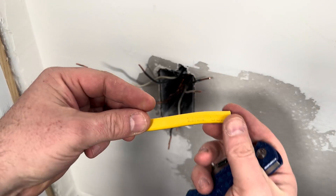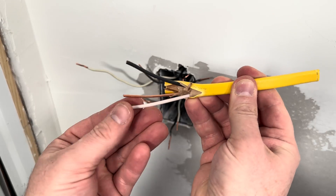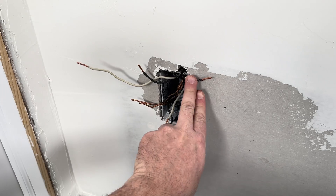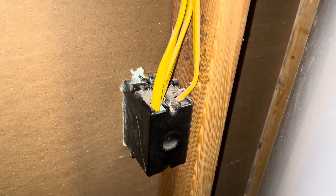To show a better view, if I were to cut open one of these yellow cables, inside you would find a black, white, and copper wire. To find out which ones are bringing in power, I need to separate the wires by cable. There's going to be three groups of wires because I have three cables coming into my outlet box.